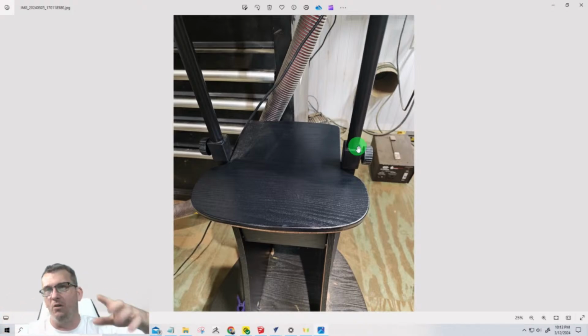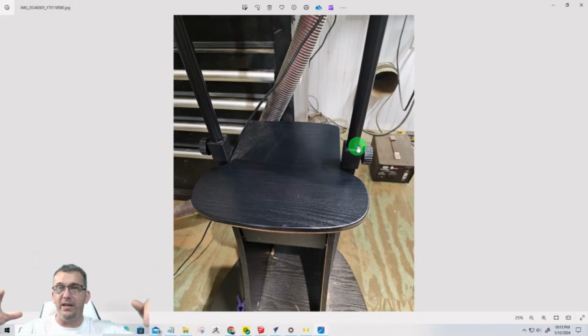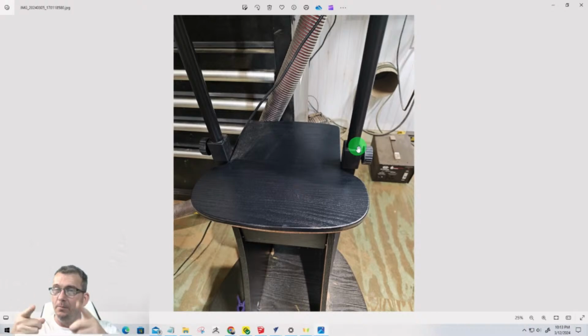All we have to do is draw a rectangle in Vectric, and then lay out our holes where our drill pattern would be. And then we could actually drill those in that dowel, and then we could put threaded inserts and make sure the threaded inserts are sitting recessed flush, so that way the rods still move up and down, but we could have positive stops, right? So you can raise it up and you can lock right in. And it'll help keep things even as well.